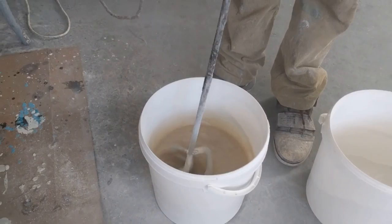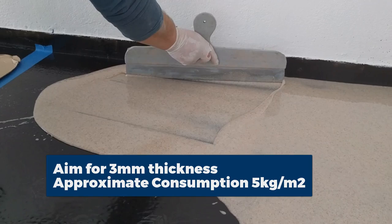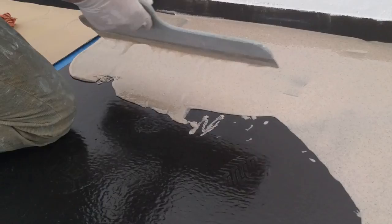You want to make sure that you add the right amount. Once you've completed the process of adding the synthetic filler, you can go on and pour the product on the floor. While you're pouring the product, I'm assuming that you've already done your priming and sealing and the floor is ready for application. Then using a trowel or a flat trowel, you can spread the product evenly throughout.